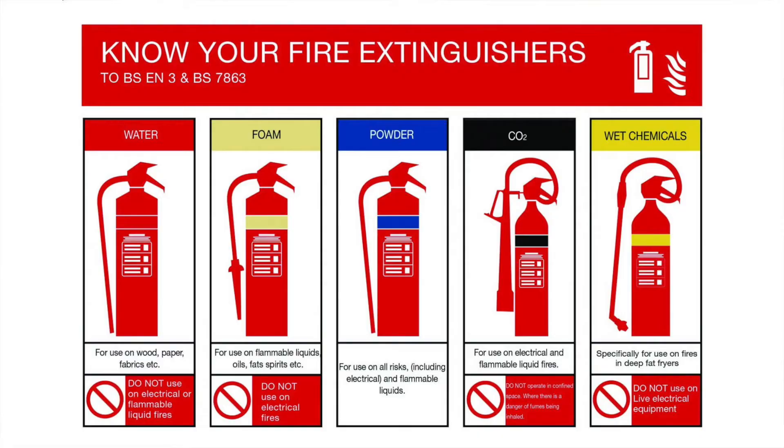If you have multiple fire extinguishers, you can use them for electrical fires, or foam-based ones for other hazards. If you need to purchase one, consider that in your workplace and office there are typically two hazards: electrical and normal. For this, the most recommended extinguisher is DCP — Dry Chemical Powder.